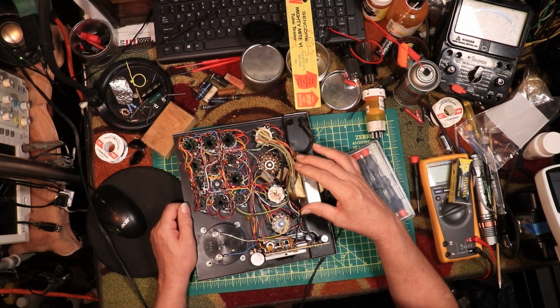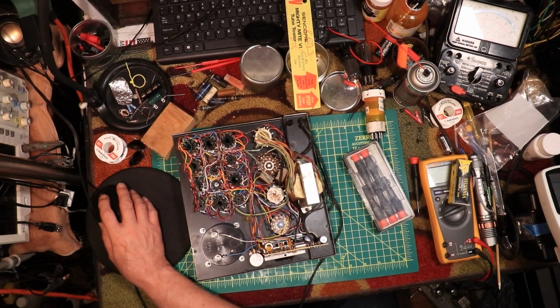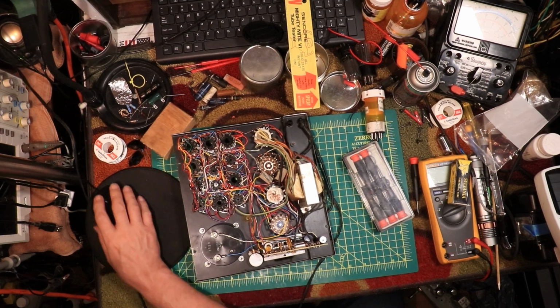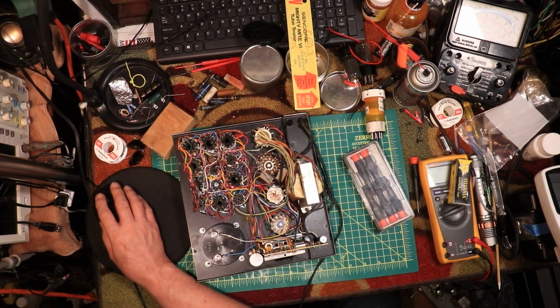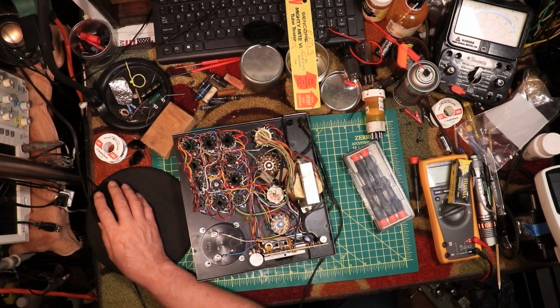The grid leakage is working. The emission's not. And that emission's going in there as per normally closed on this grid, from emissions to the grid and then out of there from that normally closed, and it's after that pot that I had just adjusted. Going in through there straight up into that FET. It's going through a resistor first, but nevertheless. And another cap, the 0.01.